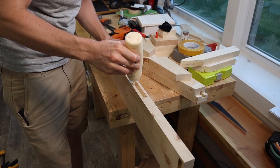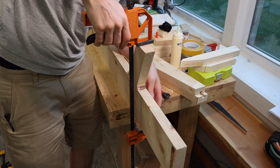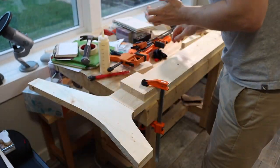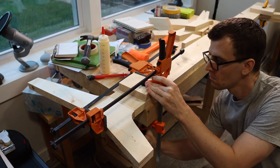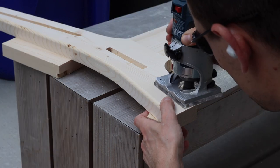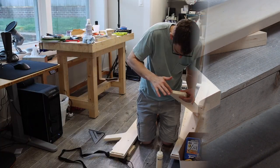With that done, I glued the leg pieces and the leg-slash-back piece onto the long stretchers. Once that dried, I went back with some homemade wood putty made of wood glue and sawdust and filled in any cracks. Before putting all the rest of the pieces together, I used a roundover bit in my router to give a nice rounded edge to almost all of the pieces. Then I glued both sides together.